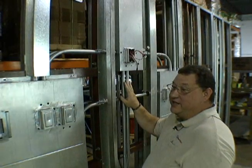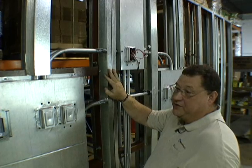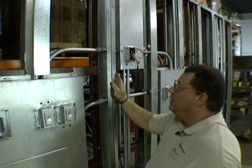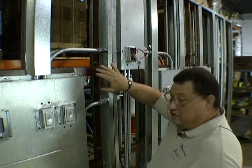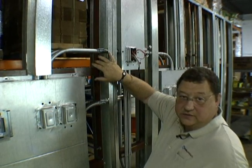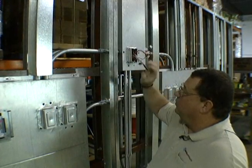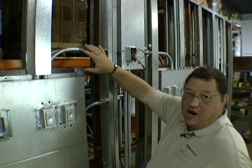We've created our 16-foot wall in two 8-foot sections so that it's easily transported and easily brought into the job site. We have mounting bolts to bolt it together. We have made our wiring complete into our boxes. Our wiring will pull back through the conduit and be already there.